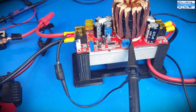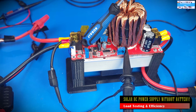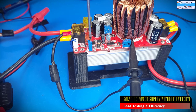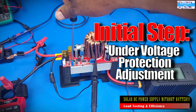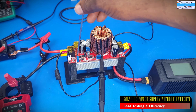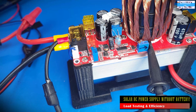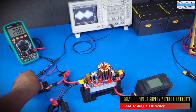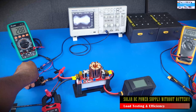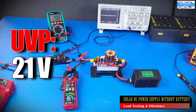So one of the adjustments that we needed to make on the converter, which was actually one of the things that one of our subscribers recommended, and I've done this in the past and it didn't give me a good result, but it works better with all the modifications that we've made. So that step is essentially to adjust the UVP setting of the converter low enough such that when we apply load, the solar panel voltage drops, but as long as it doesn't drop below the UVP setting, we're not going to get any oscillations at the input of the converter. So to do that, we dial down the UVP to about 21 volts.